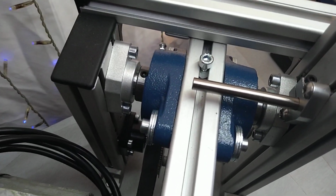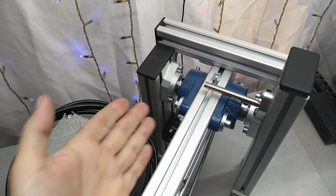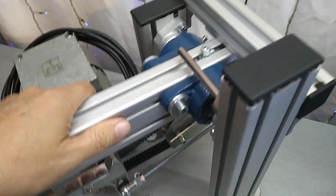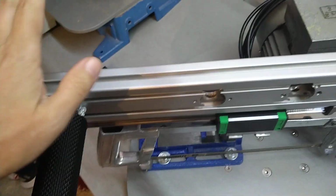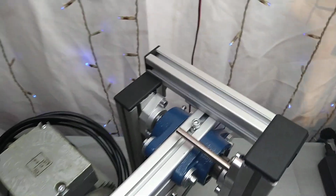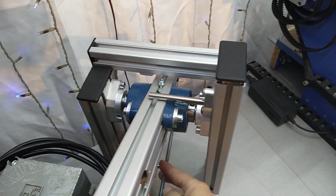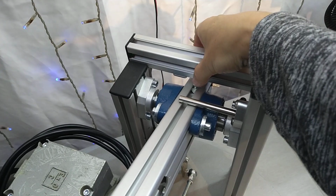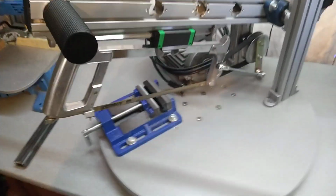So this came out, and the thing is, I don't have a welder. I'm using aluminum profiles, so that's why I want everything to be screwed down securely. And it definitely is securely screwed down, and I have this one brace that I bought afterwards, and this acts as a stop so it won't fall down. And here I also have a stop for the top, because otherwise when this turns it would hit the bottom of the profile. And I have a really simple stop for keeping it up, this one screw here, so now it stays up and I can mount my stock and cut it.